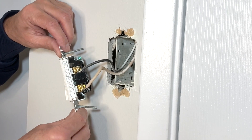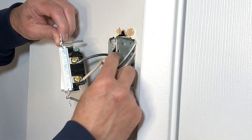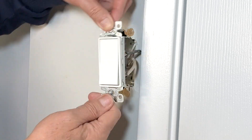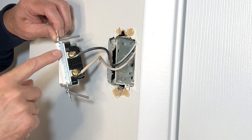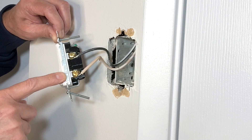This is an old house built around 50 years ago, so I don't see any neutral wire here. I only have a white wire and a black wire. The switch is not connected to ground but the ground wire is bonded to the box. Now, which one of these is a hot wire and which one is the load — I can check that but it doesn't matter.